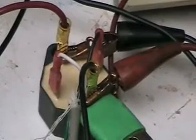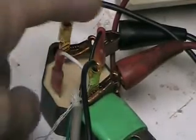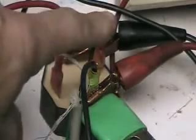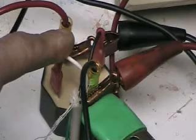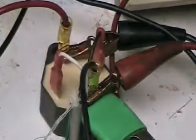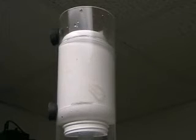There's our bridge, and you can see this is the AC side going straight from the hundred and twenty-four volts AC. As soon as I plug it in, it's going to be putting out about a hundred and seven volts DC on this side. I'm going to tell you the minute cycle and I'll tell you as soon as I plug this in when it goes.